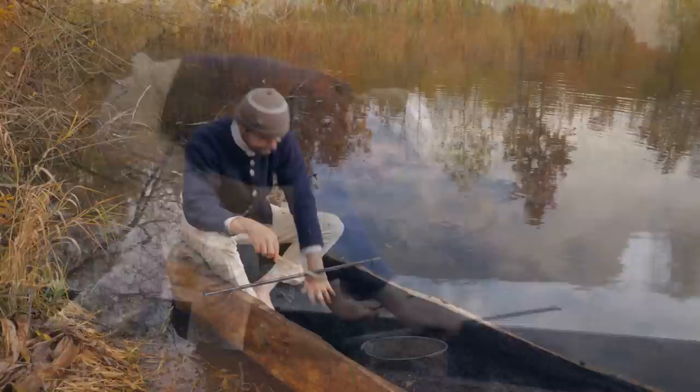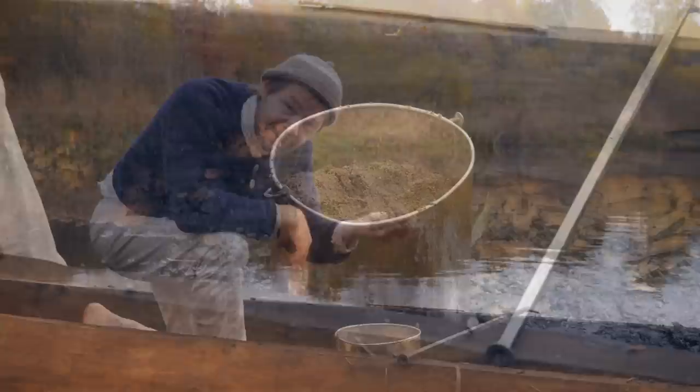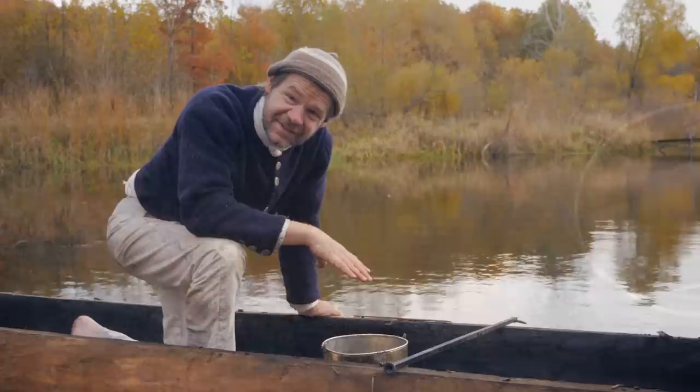I was talking to Erik about this early on when we were discussing the burn, and he said if there are times when you're getting too far on a spot, especially on the bottom, you can cover that spot with sand to use as an insulator. So I've got a bucket of sand here that we can put in the low spots and then continue burning. There's a problem though with the sand, and that is once we start using the sand, we cannot come back in here with iron tools, because if you hit the sand, it'll ruin the edges of the tools.